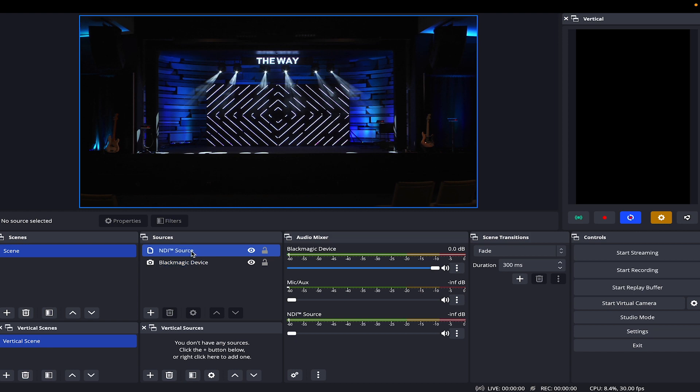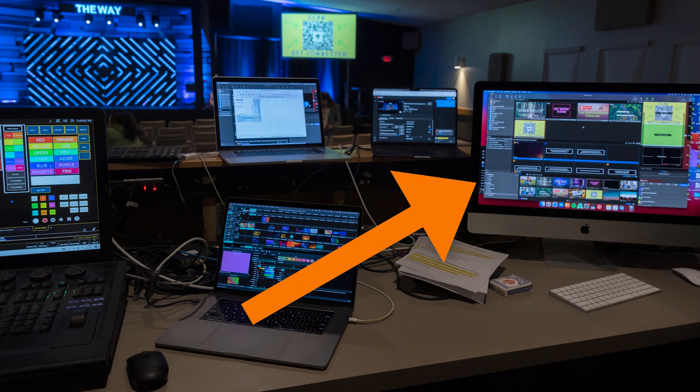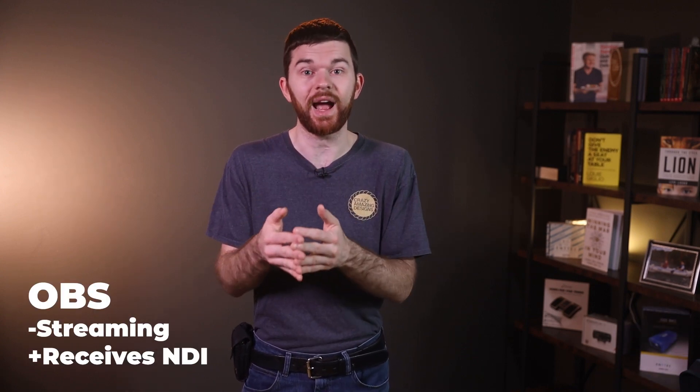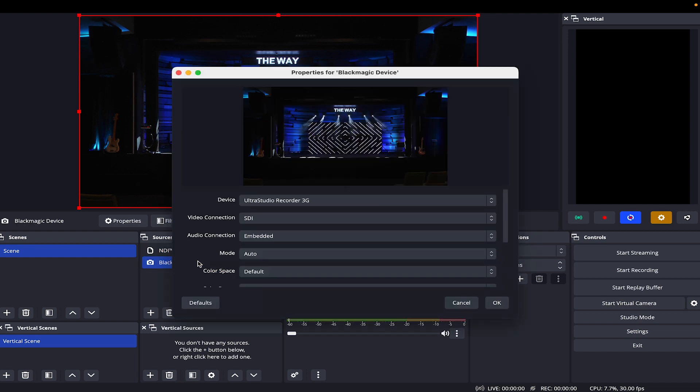Click on the card in this video to watch that video and see how this device works. We've got our source, the Blackmagic 3G. I've also got an NDI source — this is coming from the ProPresenter machine streaming over the network. This computer running OBS is connected via Ethernet to the building's network. The ProPresenter machine is on Wi-Fi, so I decided that the streaming computer receiving NDI would take more bandwidth than just pushing NDI lyrics to the OBS streaming computer. So now I've got graphics, video, and audio coming in from the camera.